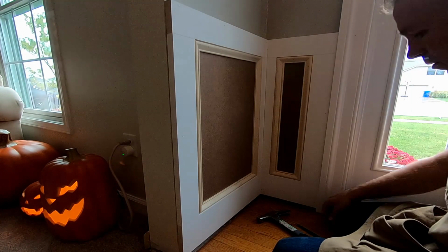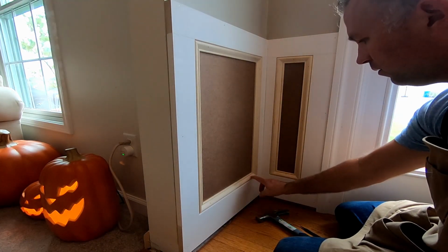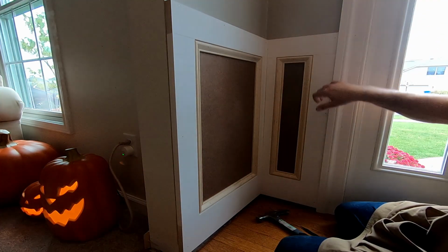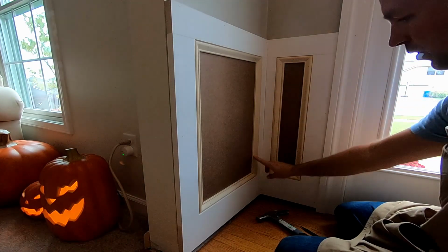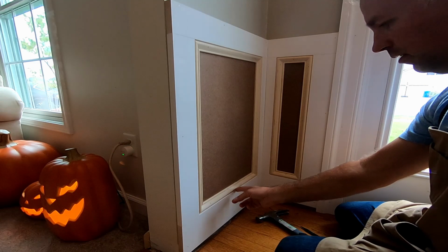Well, there you go, guys. Make sure you get yourself an awl and a hammer. Get all these trim nails in here so they're a little bit under. I put the MDF boards in here that I cut out. These are the 2 panels that we built downstairs. And then I cut a bunch of this trim wood at a 45 to make a little picture frame here. And then we just nailed it in.